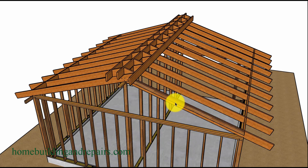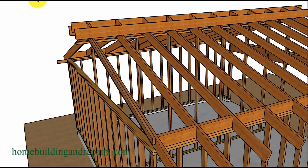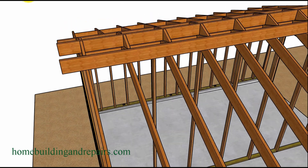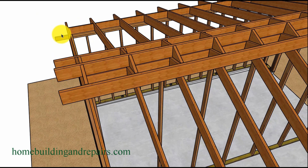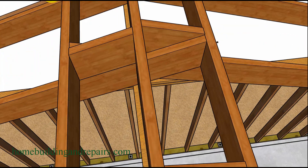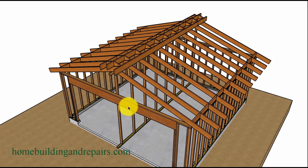With this method, you will need to add a 2x4 to the top here so that when you put your gable studs in they will line up with it. You could always use the same board you're using for your rafters if that's going to work out better for you. The fill boards would just simply sit on top of each rafter and you could nail these into the other rafters and then in-nail into the boards on the side. You could nail it into the ridge, put toenails in, do whatever you want to make it a little stronger without weakening the structure — sometimes putting too many nails in splits the wood and you've defeated the purpose.